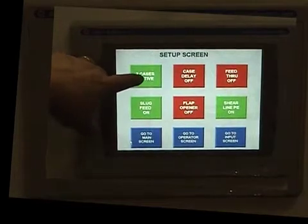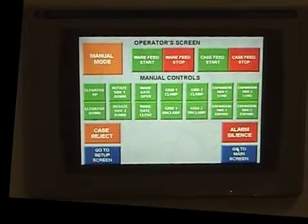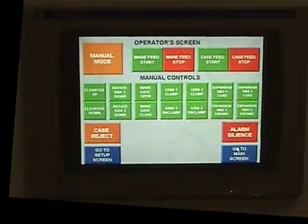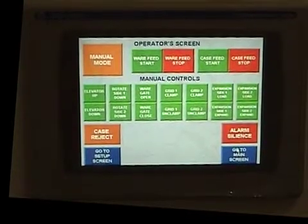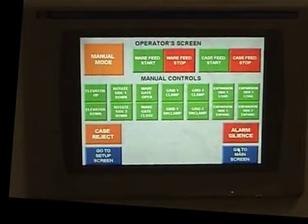An alarm screen is provided on the touchscreen for shear line, photo eye block, down bottle and minor case failure, and line break. Major alarms must be reset by the operator. Minor alarms provided include wear prime and case backup. These alarms will reset themselves.